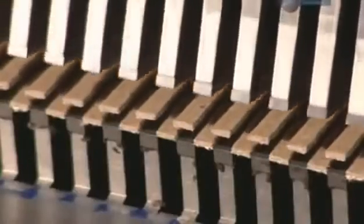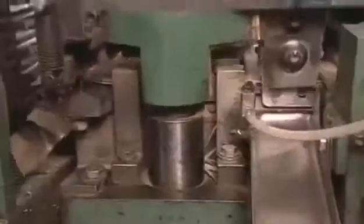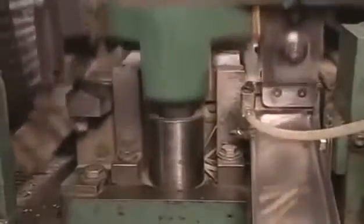A stamping press partially cuts the paper, creating stems. As can be seen in this view from inside the machine, a die first cuts the stems. Then a blade slices through the sheet widthwise, making strips of 120 stems each. At actual speed, it's just a blur, as the press makes nearly 500 strips per minute.